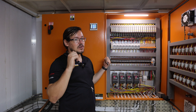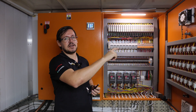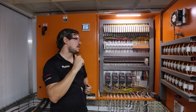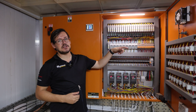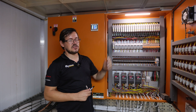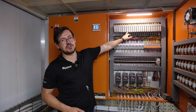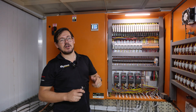The other thing contactrons do is if the isolator is off in the field, the contactron will tell you the motor is not drawing any amps. So if your cleaners, for instance, forget to turn the motor back on, this will tell you the fan is not running. This little piece of equipment is your insurance to make sure your bin fans are on when they should be on.